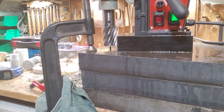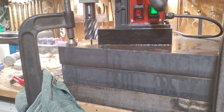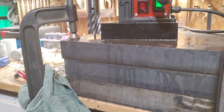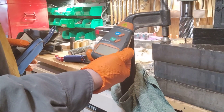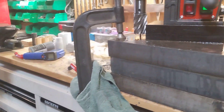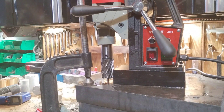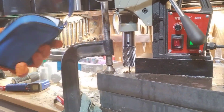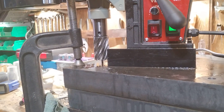I'm going to turn it on. To set the RPM — the recommended RPM for an inch-and-a-half cutter is about 213 RPM according to one source, another said 240 to 400. I set it at about 238. I used a DT-2234C+ digital tachometer off Amazon for about 15 bucks in 2023. You put a little piece of reflective tape on the shaft and it tells you the RPM. This thing comes with reflective tape but it just fell off as I was using it — this thing gets completely piled up with chips. So anyway, I know it's set right.